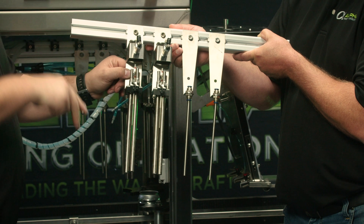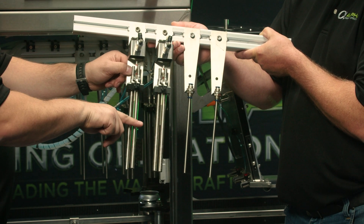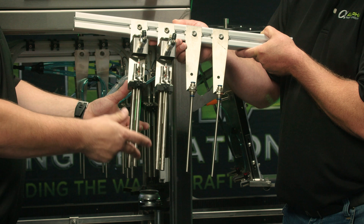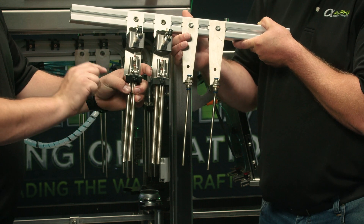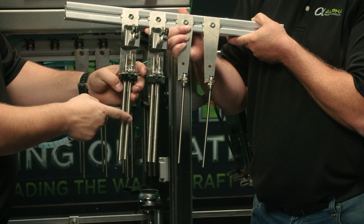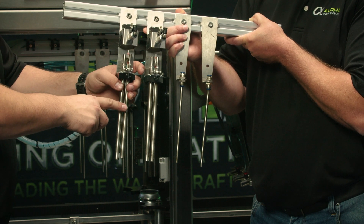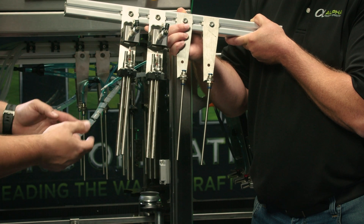The next adjustment is the height of your level probe. If the level probe is set too high, you'll run out of adjustment or completely miss the liquid level, and the fill will just spill and never stop. You want to set the probe a little bit lower than your actual desired liquid level so it has time to delay before shutoff. Setting it too low is better than setting it too high.